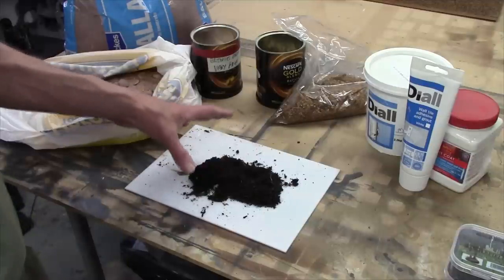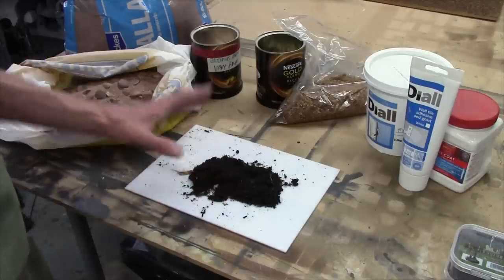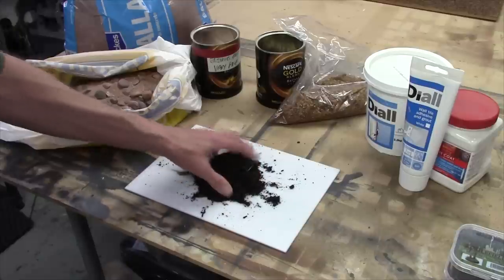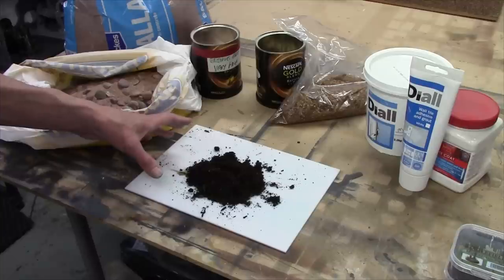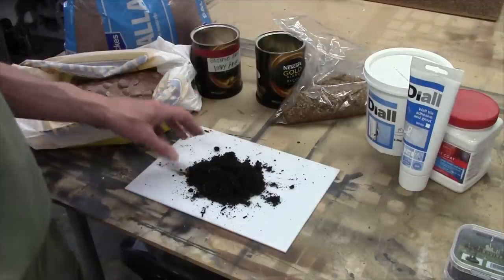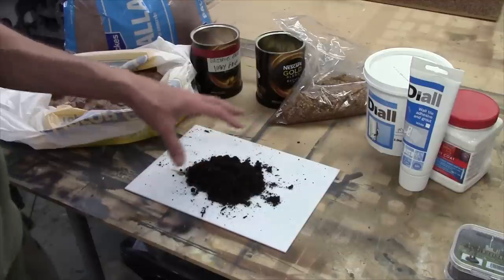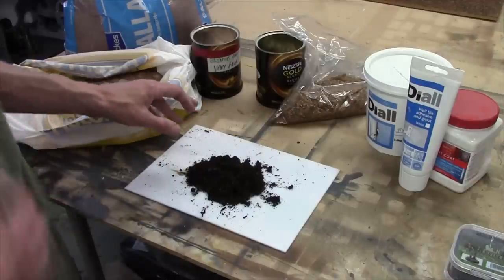At 200 degrees Celsius for 30 minutes, earth becomes abiotic — which basically means there is nothing living left in it. You don't need to spray it with anything, you just need to bake it at 200 degrees for 30 minutes and it's perfectly fine. Now you might say, if it's that easy and we've seen you throwing castings in the oven, why don't you use this stuff? Well, earth falls into three basic categories — there are very scientific names for them but I can't remember them.